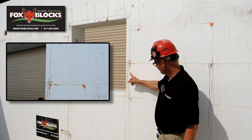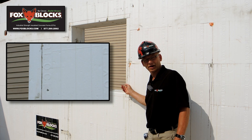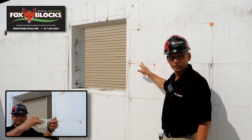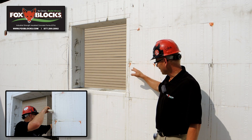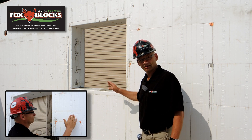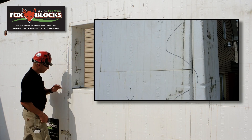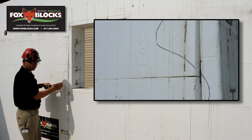If you see on this side of the window, there's a tie right close to the buck. If it's within four inches of the buck, you don't have anything to worry about. You put the fiberglass reinforced tape on and the internal bracing just like we teach, you won't have any problem. You can vibrate all you want, it'll pull just fine. If you look on this side of the wall though, they had seven inches to the tie.